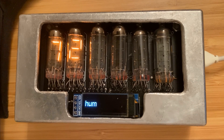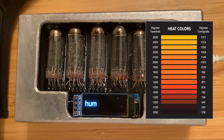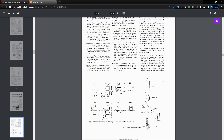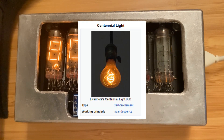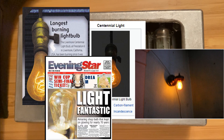These are running at about 900 degrees centigrade — you can tell that by holding them up to a black body colour chart. A typical incandescent bulb burns over two and a half thousand degrees centigrade, and an RCA publication states their Numitrons were specced for 1,400. So I really can't see these failing anytime soon. The result is they're slightly dimmer but they do have more orange colour, which I think looks quite nice. By the way, when you see claims of the world's oldest light bulb burning for 50 years or whatever, they exploit this same principle — they just run it under voltage.